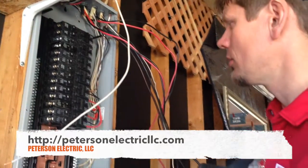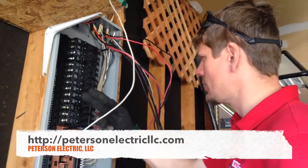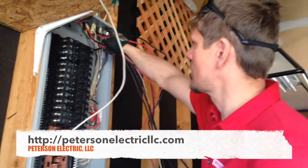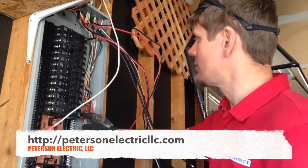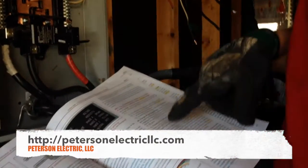Before I took all this apart, I put tape around these — just a small piece because I knew I had to cut and trim it — so when I fed it back down the Romex connectors, I also didn't lose it. Because if you hook this up to a neutral, you're going to blow that thermostat real quick. You want to make sure you identify this, and it talks about anything over 50 volts in 200.7C.